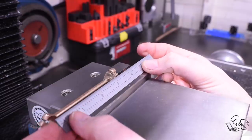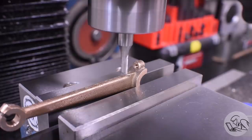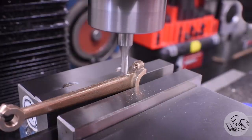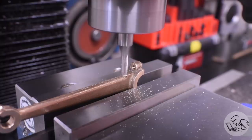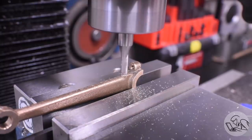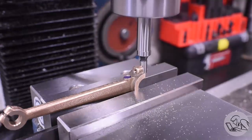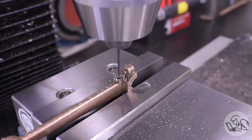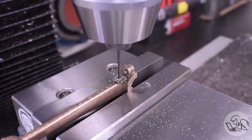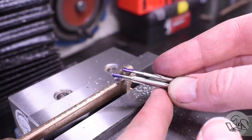We have one last little bit of plumbing to do on this connecting rod. There's an internal oil passage that goes from a lubricating cup that sits on the outside and goes down in an L shape into the bearing area. So I'm gonna start by machining that boss flat. I locate this hole on the center line on the y-axis, and then for the x we have a dimension from the drawing. There's a distance specified from the edge of the bearing cap there, and then we drill straight down. And to get the depth of thread just right, I scribed a little line on these taps that I'm going to use.